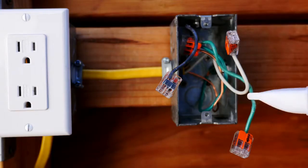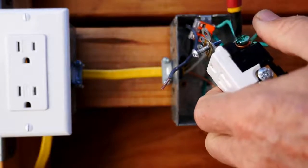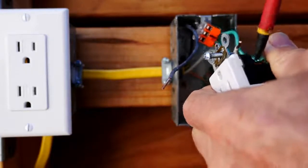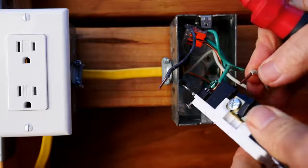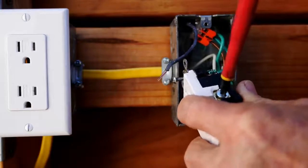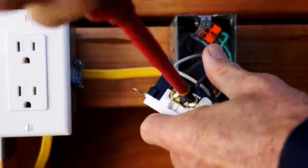I've turned off the circuit breaker and I'm going to do a double check to make sure that everything is off. Now with the circuit breaker off, I am hooking the receptacle back up. I put the green ground wire around the green terminal and tighten it down securely. This time I'm going to make sure that the white neutral wire goes to the silver terminal and tighten that down securely, and the black hot wire goes to the bronze terminal and I'll tighten that one down securely.